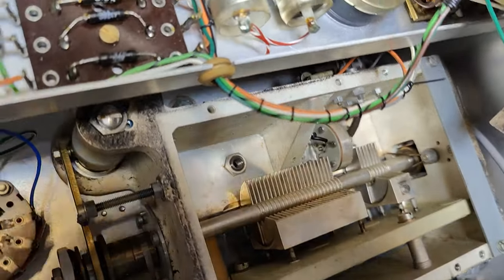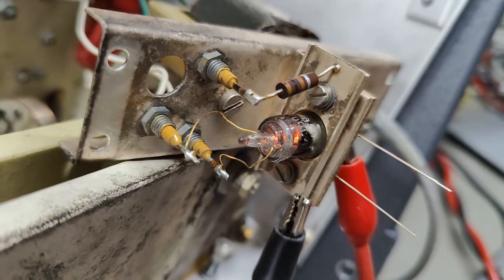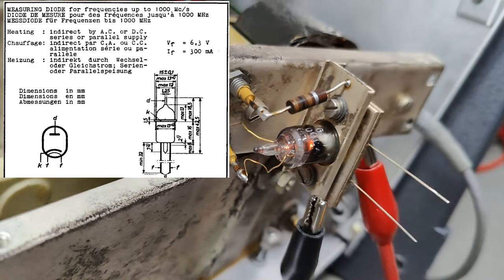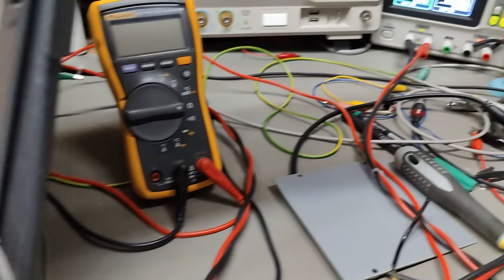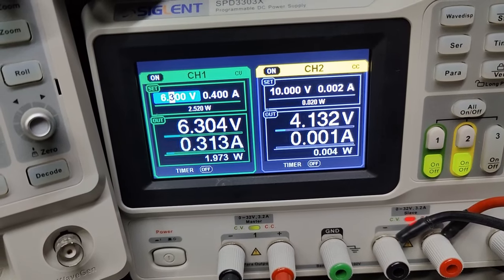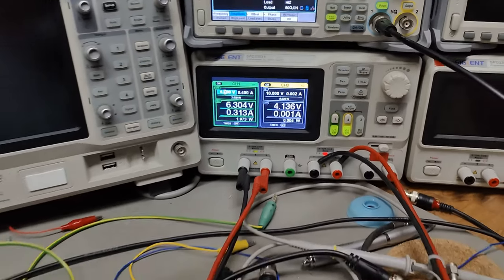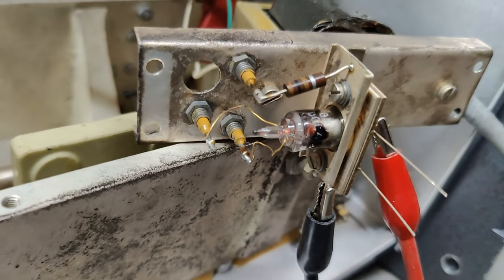It's really beautifully designed, this unit. Here's the EA-52 diode under a little test. I found a datasheet and I can see the heater is 6.3 volts, 300 milliamps, and the diode voltage should be around maximum 5 volts at a couple of milliamps. The forward voltage is 4-point-something volts and I set the DC current very, very low. After turning on the filament it stabilized at about 1 milliamp — so I think this diode is working. I find it fascinating: this diode can do 1 gigahertz — isn't that cool?